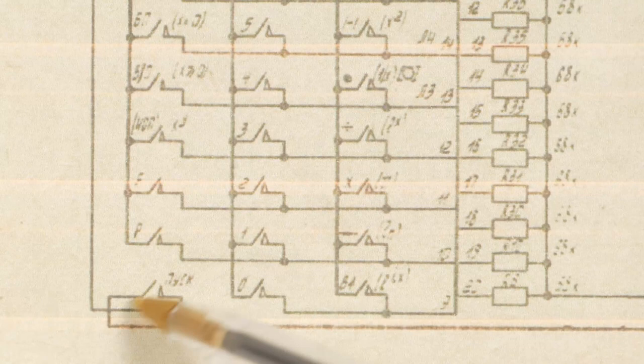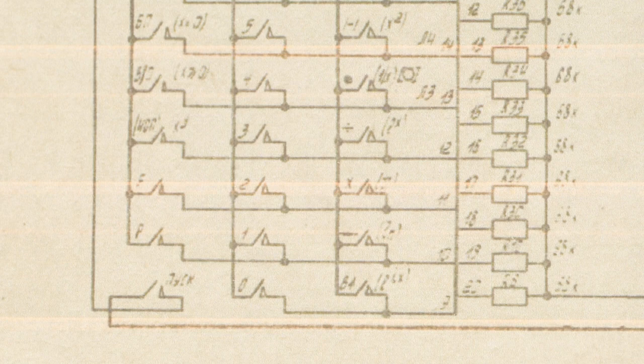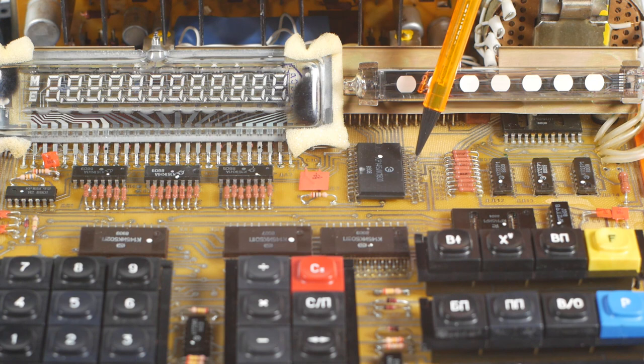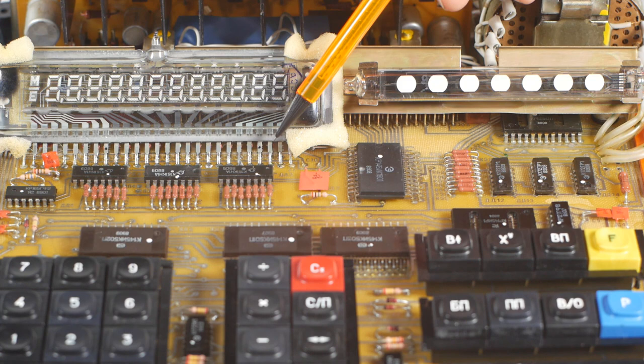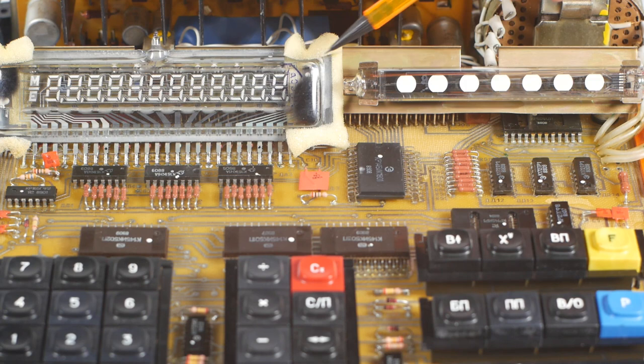Looking at the start key on the circuit diagram, it's independent of the rest of the keyboard and appears to deal with the analogue-to-digital side of things. I want to get an isolation transformer before I go probing around in the machine with the oscilloscope, but we did do a little testing using a battery-operated scope. All the sync signals are present and the multiplexing of the grids on the VFD are active, but there's no signals going to the individual segments. The heater filaments can be seen glowing when the lights are off, so they're getting power as they should be.